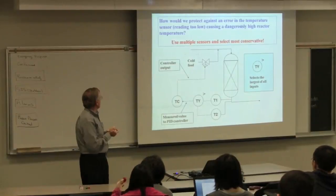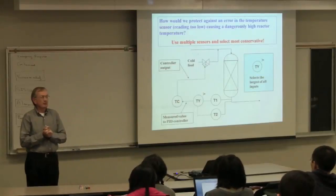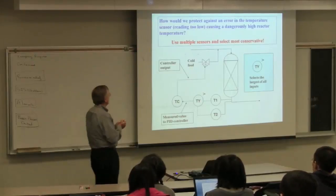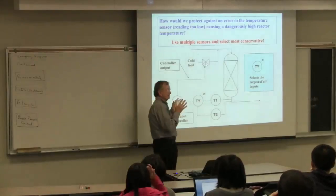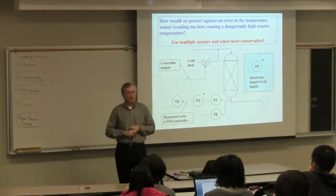Open—so I have the most cooling possible. If I want to put the temperature low, that's the same way. If something happens and I lose the signal, the command to that valve, then the valve should go open.